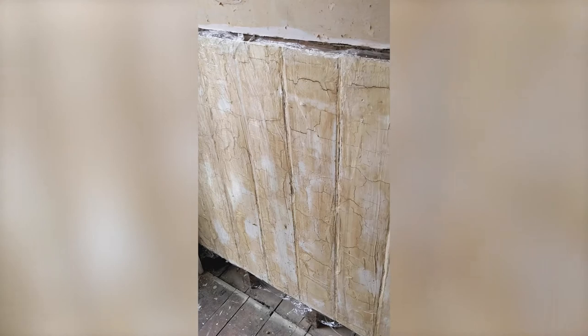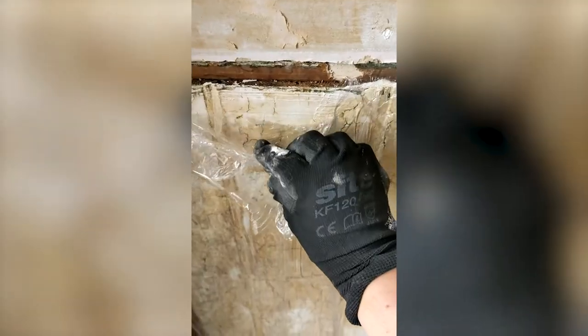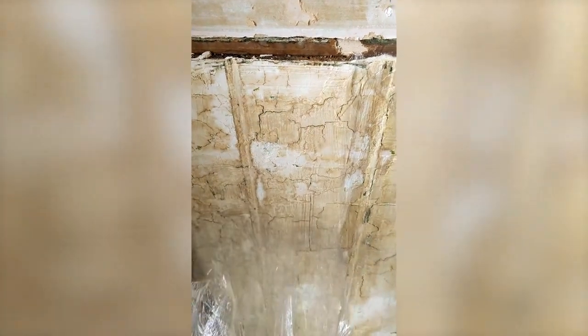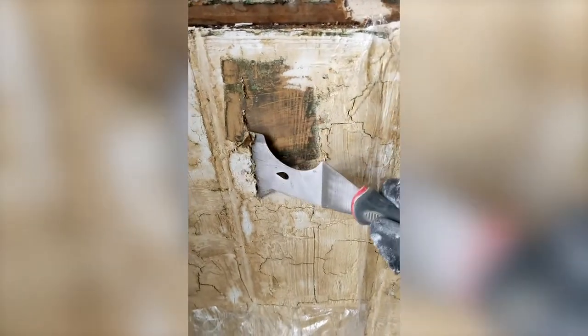The next day you can see it was bringing up all the brown stain underneath and the green paint, really getting those layers off. I would say it didn't really cling for me — in hindsight I probably should have put the cling film on each panel immediately after applying it, rather than doing it all at once at the end. But the first scrapes were promising.